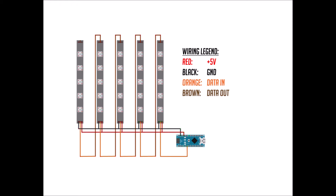You can add an optional mode toggle button to your build so you can easily iterate between the four different modes. Connect it as shown in the picture and use a pull-down resistor to clean out the low or not-pressed signal. I recommend using a 10 kilo-ohm resistor for this.